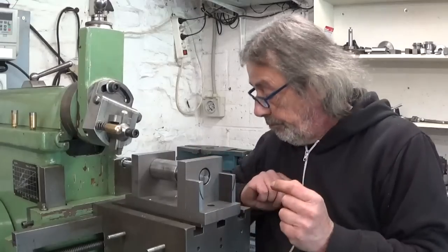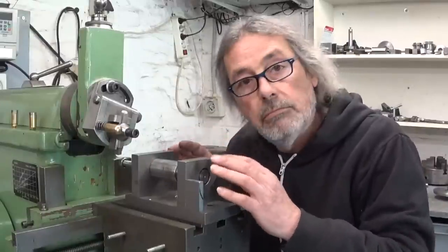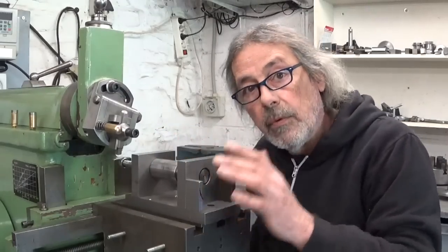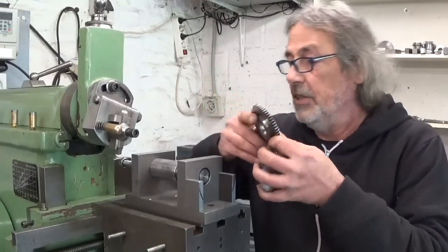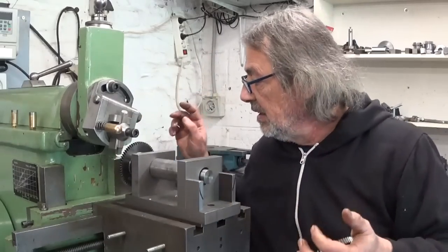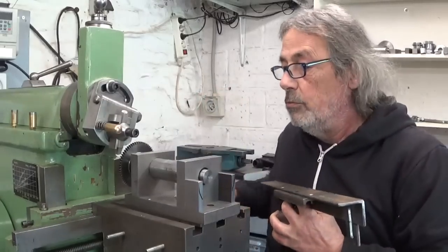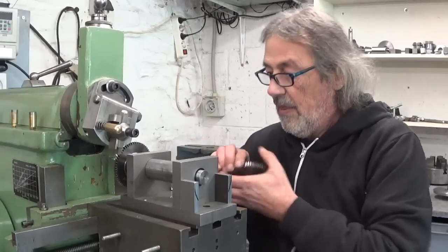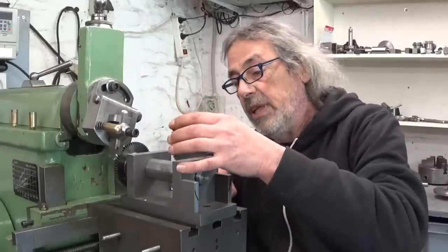And maybe you're wondering, or maybe not, why not cutting this gear here on the shaper? Let me explain. This system works best when I copy a gear. For example, this one is the original 60 teeth gear, and I installed it here in the back. Something like this, for example. And I use this gear rack that I install right here, and with the movement of the table the whole thing spins, and that's how, I hope it's not gonna fall down, that's how I can copy the gear. So this one 60, this one 60, it comes between, of course.